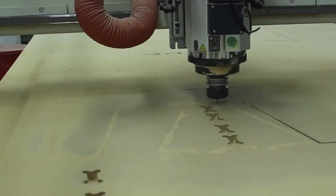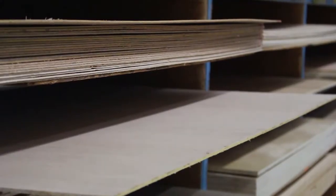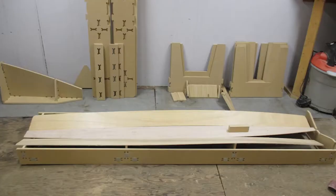The first part that I will be working on is the hull. The first step in building the hull is making a plug so we can build a mold around it. This involves cutting out a jig and some plywood sheets that fit together inside the jig, creating a plywood hull that we can lay a mold around.